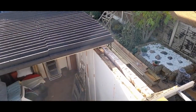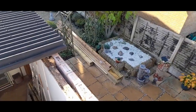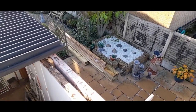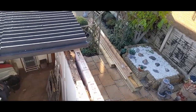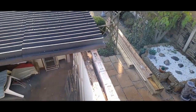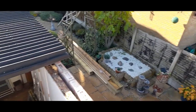Following week now — did that bit last week and I've just been taking a bit more of the roof off, about another four foot. What I'm going to do is keep it flush at the back but overhang it probably about three or four foot on the front end so they can sit under it. The customer's 93 now, so she doesn't like blazing sun. She's got a swing in the garden and I'm going to protrude this roof over — she used to have an awning that came out here but she can't wind it out anymore. I'll cantilever this bit that's going to overhang.